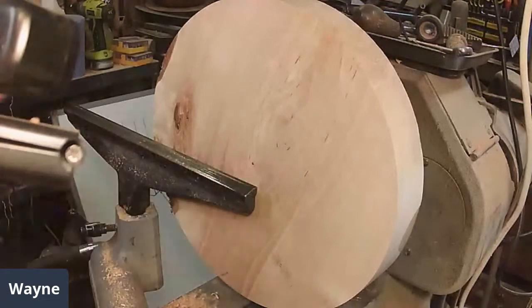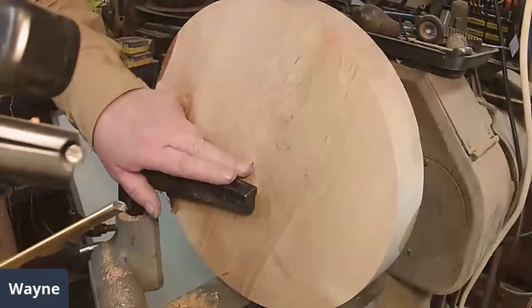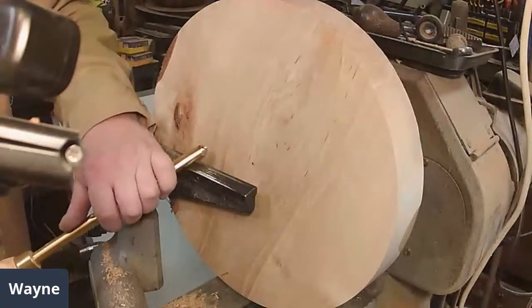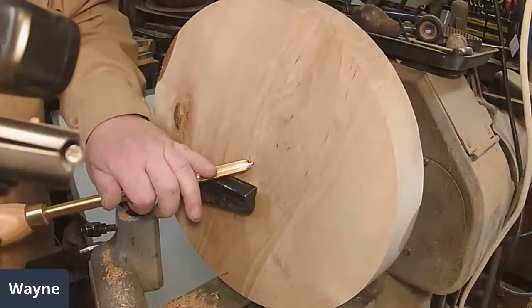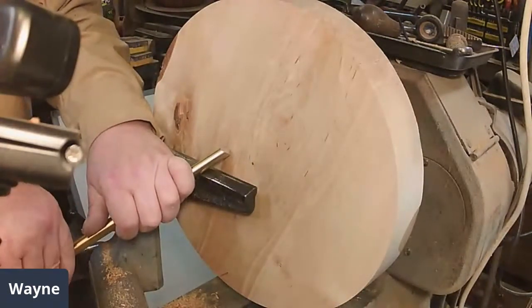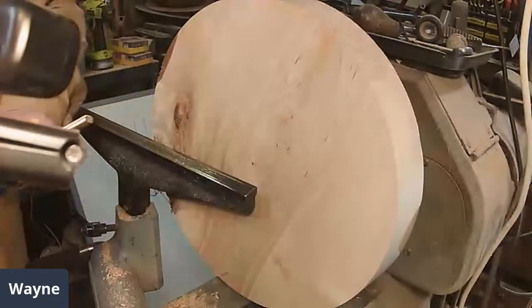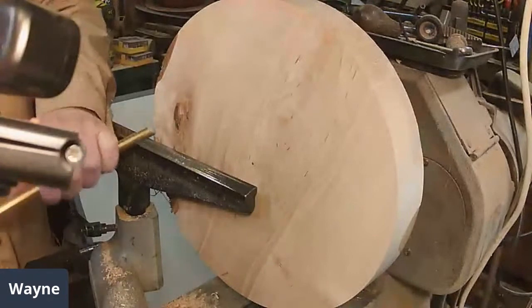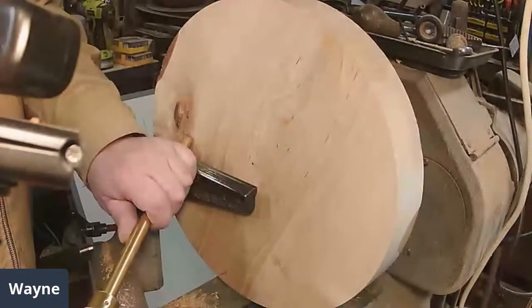Right, with the gouge, you have the tool rest below center. So when you're actually finishing a cut, see on the inside of a bowl, you're always finishing on the center point. Okay? So the handle is always down. You always have the handle facing down, unless the bed bars are getting in the way and you've actually got to lift the handle up. But as much as possible, you need to have the handle down.